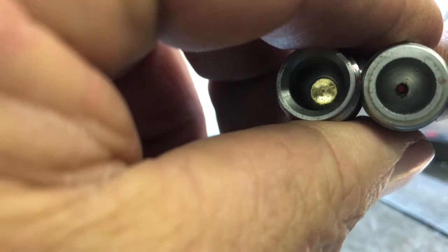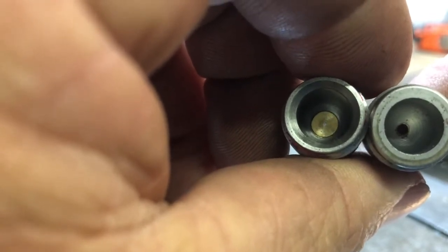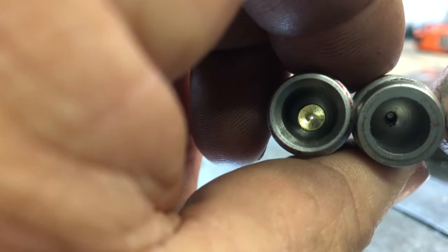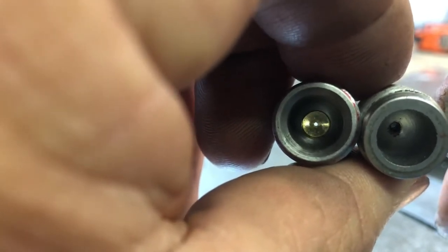So you can see this breech plug on the right's got a lot more beef around the side of it than this one does, but we should be right at the 451 diameter. And that little shoulder doesn't scare me, because as I tighten that in, that should move a little easier than that big shoulder will, so we get a good flush seat against the back of the barrel, and that should keep any kind of blowback or anything from coming out of there. The 50 caliber breech plugs look pretty similar to the one on the left. This one's out of the 45 on the right. So I could have just gone in with the 3/8 end mill and had it look almost exactly the same. But like I said, I'm not too worried about it. I'm not worried about the amount of pressure that'll come out of that and gas cut that at all. I think it should be fine.